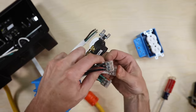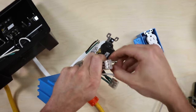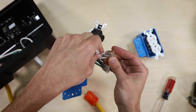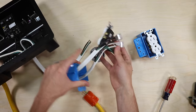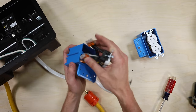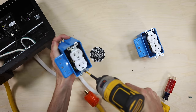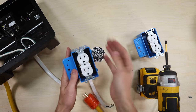It's really important to check your work here because I can see I missed a few strands of wires getting into that lever nut. But that's one of the great things about checking your work — you slide it out of the lever nut, pop it back in place, and clamp it down. Now all of this can go back into the box the same way as we just had it, except with the introduction of a few new wires.